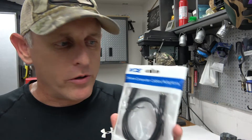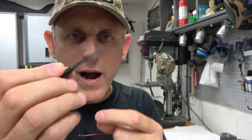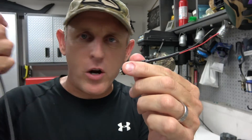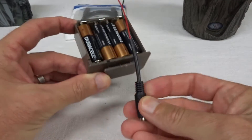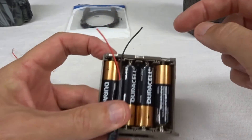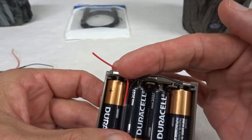What's nice about this cord is you're going to cut it about five inches back from the female end, and this is going to wire directly into the trail camera battery pack. The male end goes to your power source, and then you just plug them together — that's how we're going to wire it. I've marked where the cable needs to lay, and I'm going to secure it with a zip tie so it won't pull through, then wire the two wires under the contact for ground and positive.